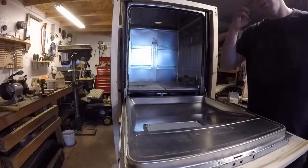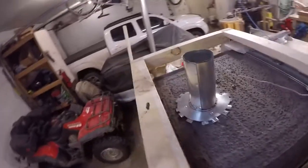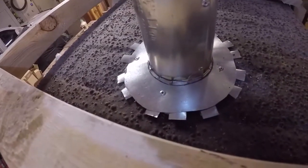We do have a two-and-a-half-inch damper up at the top. The damper has been drilled in and this here is our temperature sensor — that'll go to our PID controller. Here we built the chimney stack. We've cut out some metal, used some high-temp silicone, and pop-riveted it down, and we'll put a damper in later.